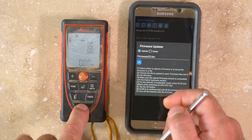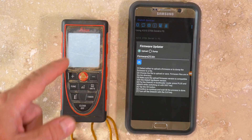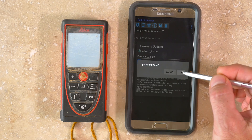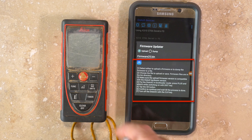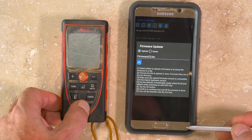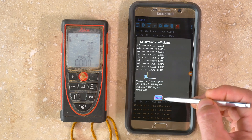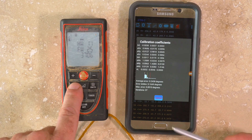Before selecting the OK button, you'll need to put the paired DISTO-X into upgrade mode. This is accomplished on the DISTO-X by simultaneously pressing the plus, minus, and on buttons from a powered off state. The LCD screen should illuminate but will be blank. Then go back to TopoDroid and select OK, and OK again to confirm. Carefully read the warnings and follow the instructions exactly, as a failed firmware upgrade can put your DISTO-X into an unusable state that may be difficult to fix. A window will pop up showing the firmware file has been successfully written. Press the off button on the DISTO-X to turn it off. When you turn the DISTO-X back on, it will display 'no cal.' At this point you can use TopoDroid to start a new calibration, or re-upload a recent calibration, and restore other settings such as preferred measurement units.